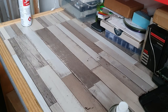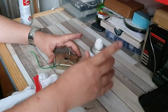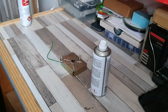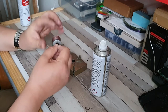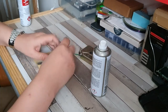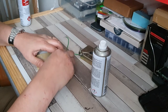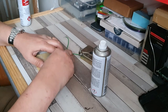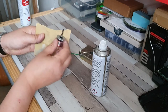Let's put this motor back together. As I was saying, the top weight obviously came off and that caused the motor to rattle - it was still working but rattling around. Because we have a bit of glue residue on here, I'm going to very carefully run this around on the sandpaper. You don't want to do it too hard because you don't want to remove excess amounts of metal - all you want to do is just remove the glue residue.